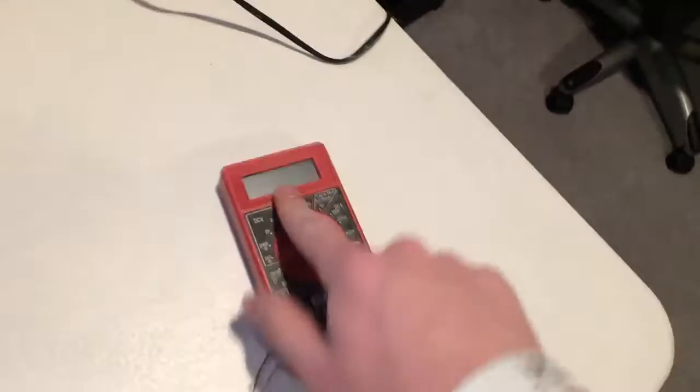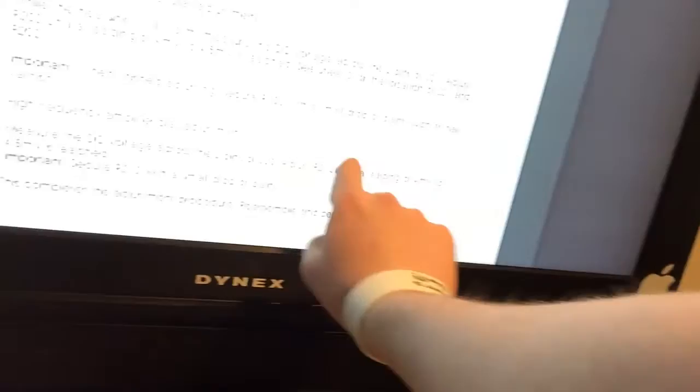We've got the test points right here. I had to jury-rig the multimeter — I sacrificed a connector and put this end on it so it'll plug right into the board and read the voltage. We need to get it between 4 to 4.5 millivolts, right somewhere in there.